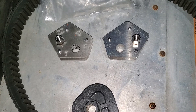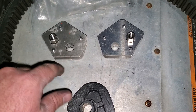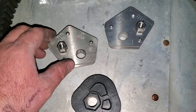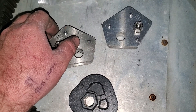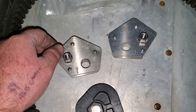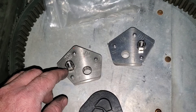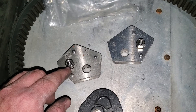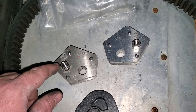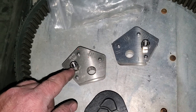A gentleman that owns a business called Barn of Parts Sled Salvage out of Pennsylvania invented these little gadgets right here. They look very similar, but there are several advantages to them. You have soft, medium, hard — those are all three the stock settings — and then you have an extra setting which is a little bit harder than the standard hard setting. The other advantage is it's metal, and additionally the adjustment nut is offset from the pivot point. So as you turn it to the harder and harder setting you have more and more of an advantage based on the position of the adjuster, giving you a little bit more leverage.